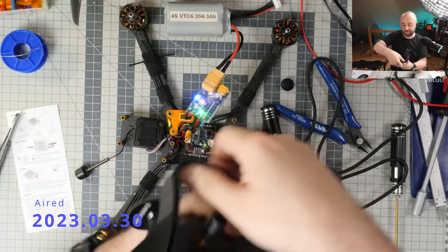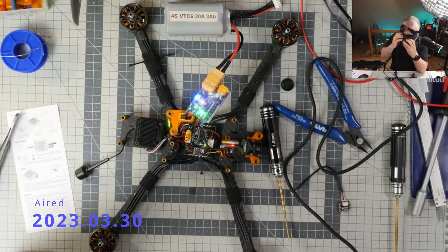You only have to ensure that you updated your avatar hardware to the latest firmware, and done. No messing with activation, no different firmware versions for different types of devices. You just flash the latest firmware, bind the goggles or receiver with the VTX, and everything works out of the box. There is even a livestream of me doing assembly, binding and firmware updates, where you can see how surprised and happy I was because I never had any problems while setting everything up.